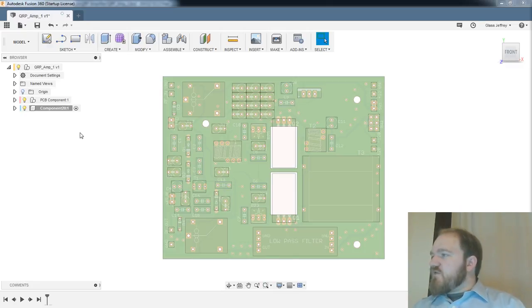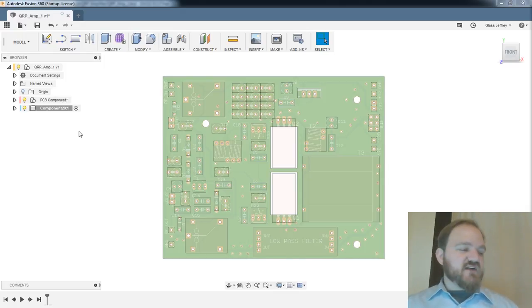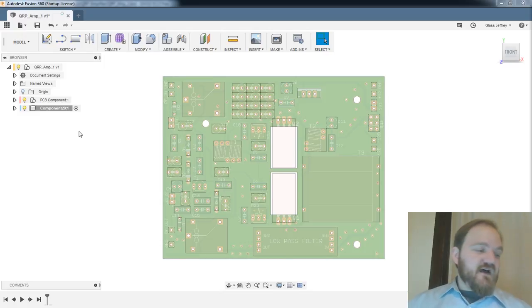Looks like the marking in the courtyard mechanical lacking 3D model. Courtyard is a general mechanical clearance outline. Aaron says, stupid question, why can't they put a hole in the board for you? They should be able to. I think what's probably happened is I am not marking it up in the way that they expect. The documentation for this process from JLC is not great.